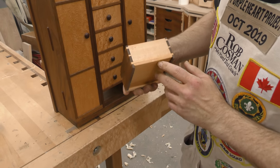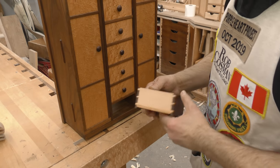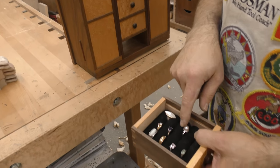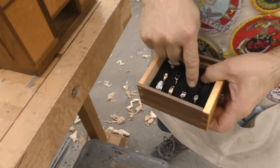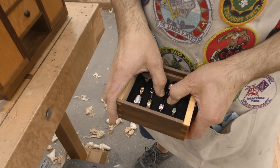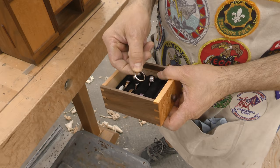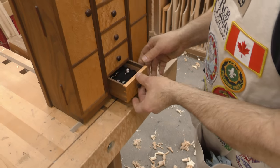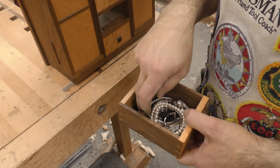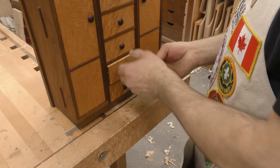The bottoms were plywood sitting in a groove on three sides. Then we customized each one. This is a piece of leather — the round portion is just foam weather stripping. And if you look in there, there's a little brass rod, eighth-inch brass rod, that holds each one of these separate, and it's a nice place to hold your rings. This one is just leather-bottomed. It's nicer to drop stuff into a drawer that has a leather bottom rather than wood — deadens the sound a little, makes it a little classier.